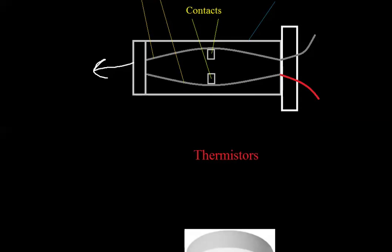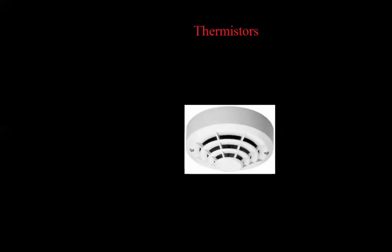The last type is more common in addressable heat detectors — a thermistor. A thermistor is like a resistor whose resistance changes with heat. When something heats up, the resistance of the device changes. Onboard circuitry processes that change in resistance and communicates with a panel to indicate alarm or normal status. The thermistor would be right in the center of the detector. These are most common with addressable devices, but you'll also see them on some conventional heat detectors and more commonly on smoke detectors that include a heat detector — a combination device to detect both smoke and heat.